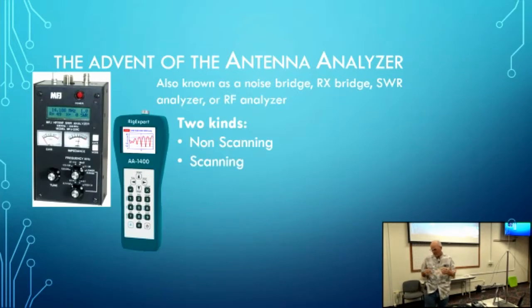But one of the big advantages of these is that you could set up and test an antenna, like this beautiful antenna here. I built this antenna in the late 1990s, and this is the antenna that I spoke with Mir Space Station on. It's an SO239 and some house wiring. That's it. But it allows us, using low power, to test our antennas, tune our antennas, get good ideas of things, and it does a whole lot more than that.